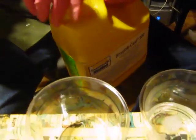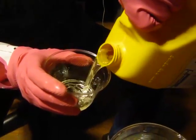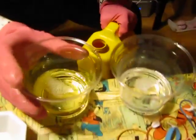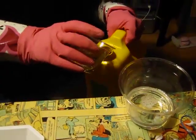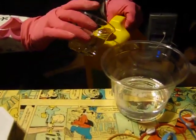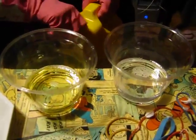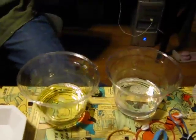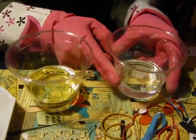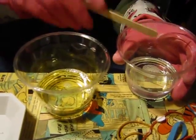I've got to pour an equal amount of the hardener. I compare them — sometimes I pour a little too much and then I can pour it back into the bottle. I allow the clear one to have a little bit more since not all of it will come out when I pour it. Now, if you're going to mix color into your resin, you would mix it now into the clear one — stir in your color, then mix them together. I'm going to cast white toys today so I'm not adding any color.